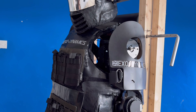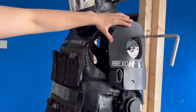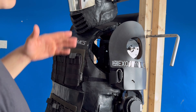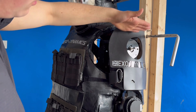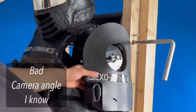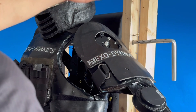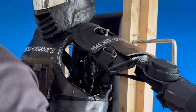Moving around to the shoulders and pauldrons, I made some improved prop pauldrons just out of 5mm acrylic formed roughly to shape and painted black. They give an idea of what it'll look like in the future. What I've realised is that realistically the pauldrons won't actually be higher than the motors — you can see where the motor would come out of this hole. Any higher than that and you get contact with the top of the chest plate when you raise your arm, whereas if the armour stops just above the motor you should have clearance all the way up and it won't clash.